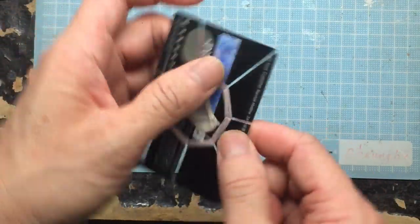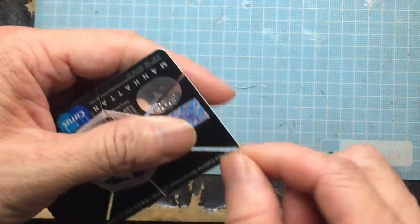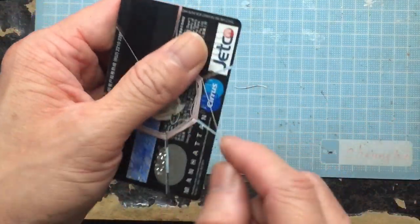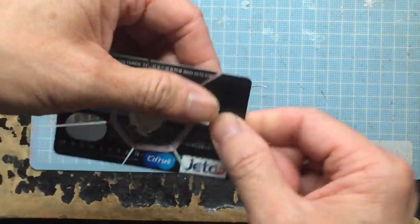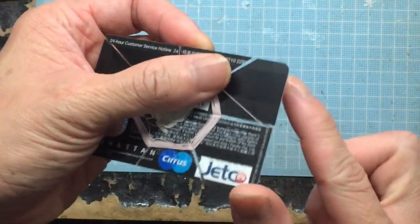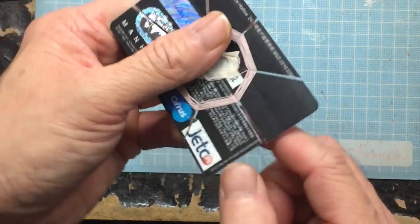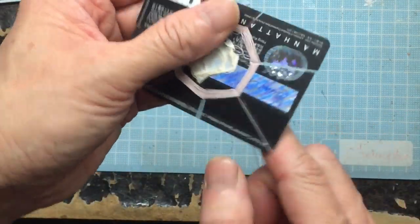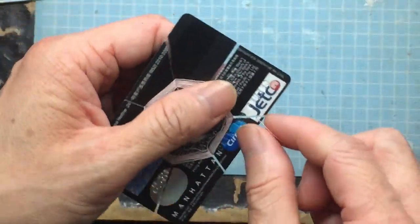Also, it will increase the distance between individual turns, thus making the coil more efficient. The amount of energy loss will be reduced, and it will be much better. The coil resulting from this type of winding will have a higher Q than if you just wind it all on one side.